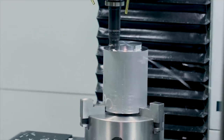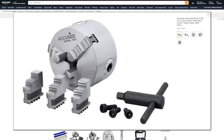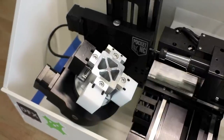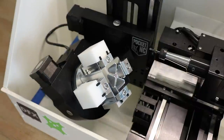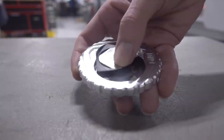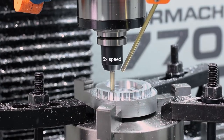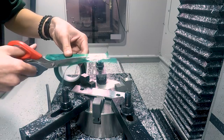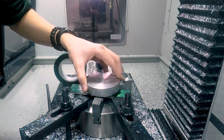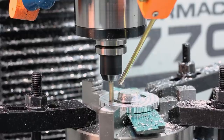If you're thinking about picking up a new three jaw chuck, look for one that has an extra set of jaws or reversible jaws. That way the same chuck can hold material both with the inside of the jaws as well as on the outside of the jaws. In Wednesday Widget 224 we made a Pocket NC tombstone out of a piece of three inch raw material — best way to hold that is with the chuck and the subplate. In Widget 230, Alex was making a Wankel engine fidget spinner — a really cool project for teachers and educators looking to combine STEM topics around engineering and automobiles. The takeaway is that Alex didn't use the base plate and just held the chuck with some strap clamps, but also used parallels to space the material slightly off the bottom jaw and used high temp powder coat tape on those parallels, which minimizes the risk that metal on metal contact will mar the surface of your part.